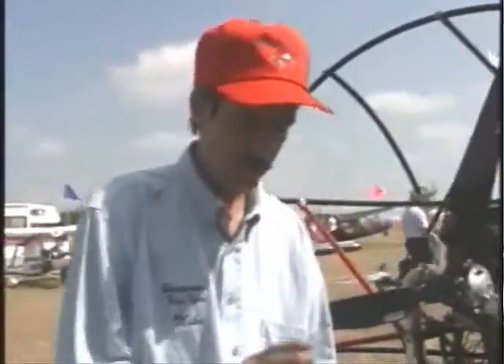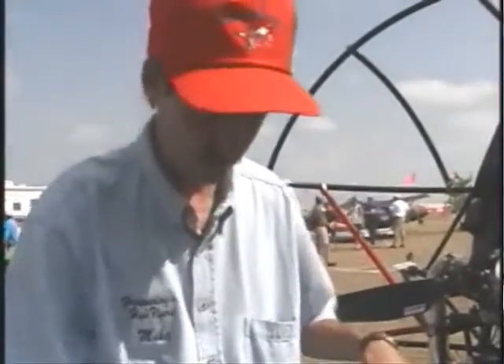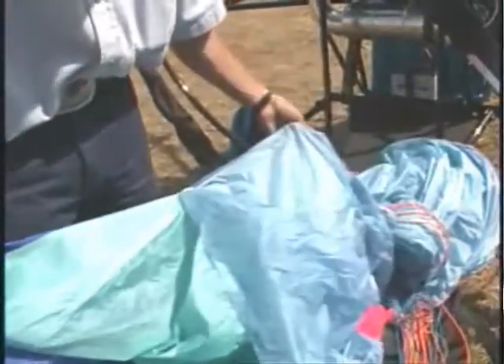What people don't realize is that this parachute is your wing. If you change one line in this parachute and shorten it by just two inches, you've changed the shape of the wing and created something that could be dangerous to get in the air. The same applies to parachute material repairs done at home on their own sewing machine. So I check for rips and tears, try to push through the material. You can see this parachute's been well cared for — kept in the bag when it isn't in the air. Check the mylar inserts. Lay it out flat upside down, check all connection points on the lines, flip it over, check the top, and look inside the cells for muffler burns. Do a real thorough inspection.